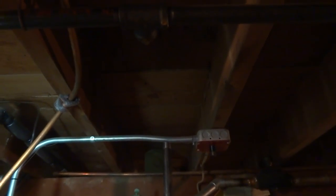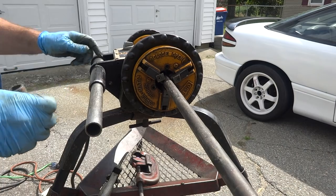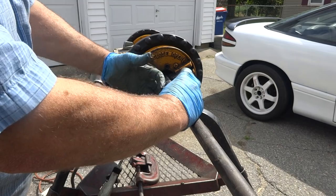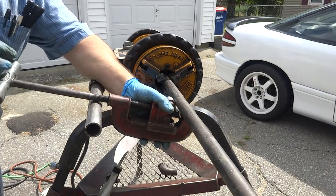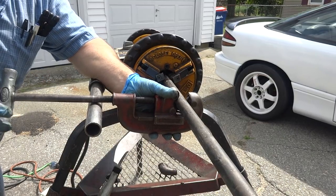Alright, then we'll get our offset piece. It looks like I'll just need a couple of, an elbow and probably a short nipple or something. Or maybe a 45 or something. We'll see what we got for a piece. Alright, so I gotta use a street elbow and a regular elbow because I don't have a lot of space down there, but I'll be alright. Good enough for this neighborhood. That's gonna be my cut right there, coming off the main.